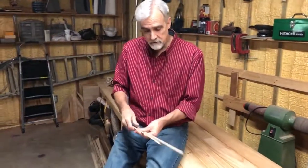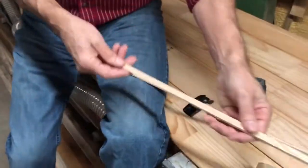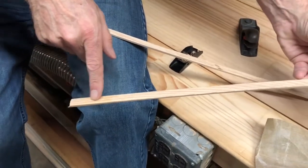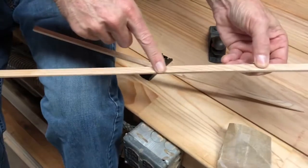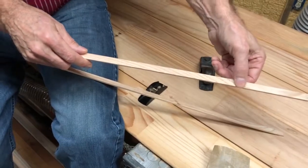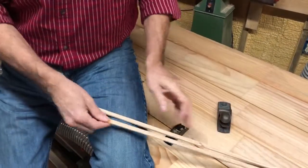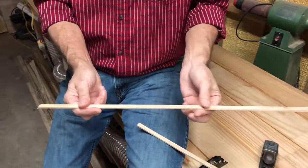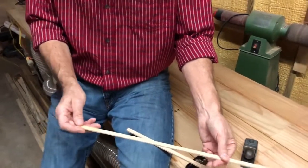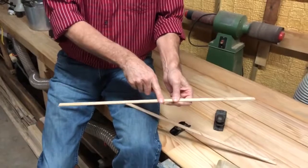The next thing to look for is what I call — I think the proper term is — grain runout. If you look at your rib stock, if you select good rib stock it'll be mostly straight, but you're going to get to a point where it runs off the side. This is where your ribs are going to break when you go to twist them during installation. So when you're selecting which ribs to put in the boat, if you have grain runout, try to plan that rib so the grain runout is not in a place where there's a severe bend.